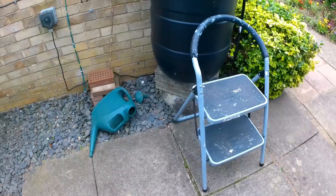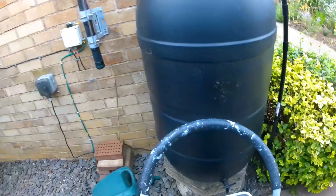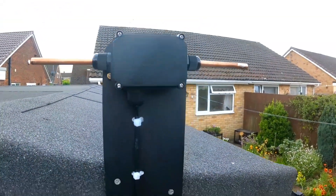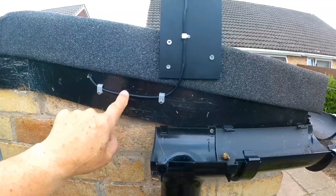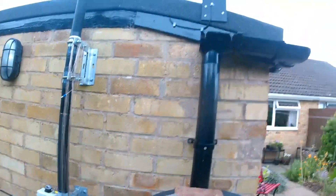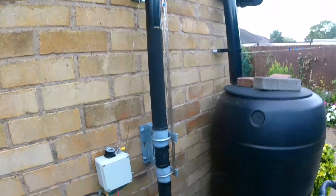I've got my aerial up now outside and it works extremely well. It does have a little bit of hiss — it's not fully quietening on the receive — but when you see what the aerial's made from and what it looks like, you can understand it. This is the aerial here against my hand; these are very very short. The SWR is on the frequency I want, and I've run it on thin coax because that's all I've got. A couple of cable clamps sit it up there, and then I've got my right-angle stick up there, and my telescopic HF aerial sitting here. There are no aerials to speak of on the bungalow.